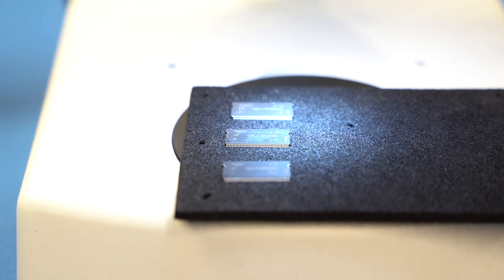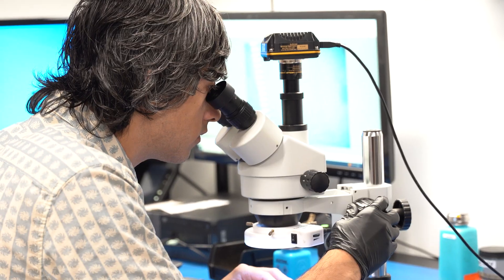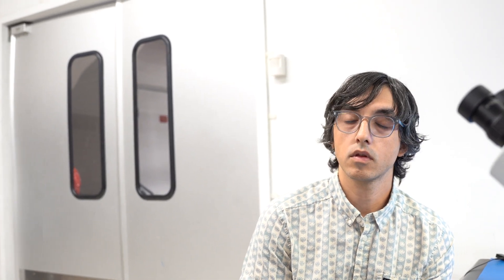It's been a while since we've had a counterfeit video here, which is good news. Today we're here with Oscar, one of our QC techs, and we found something. These parts came in and something that kind of came up right away was the condition of the parts itself — the leads — and that made me look into them even more. They failed the scrape test, but they did pass acetone.